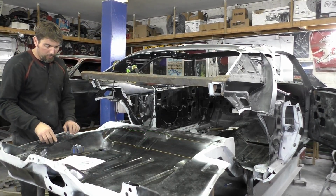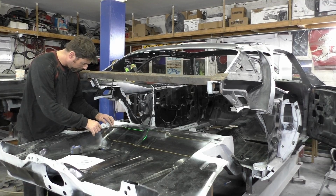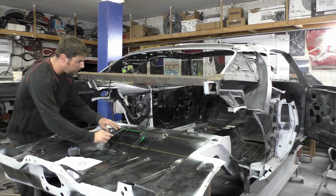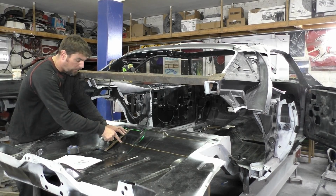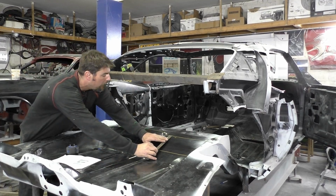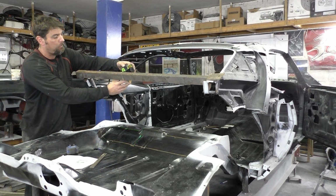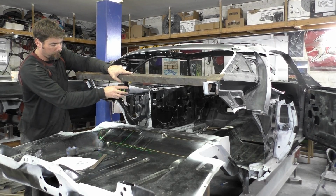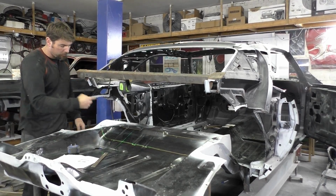Then what it said was to go 6 inches back over here. And so we went 6 inches there, and what I heard it also said, you're gonna look at 6 5/8. So your distance, since you're going down on an angle, is gonna be 6 5/8 inches. So we basically made a couple marks off there at 6 5/8 inches. Then again, same thing with this laser. We put it on this area, and same concept, we were able to connect the dots and trace our line.